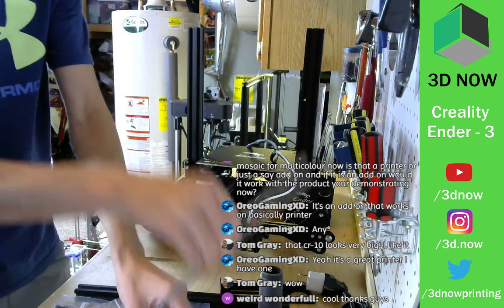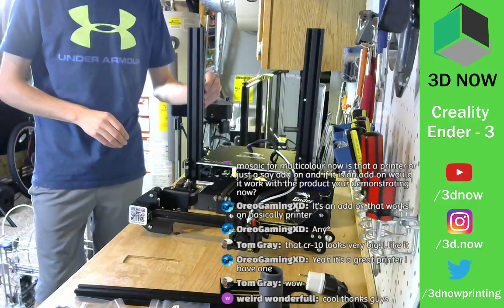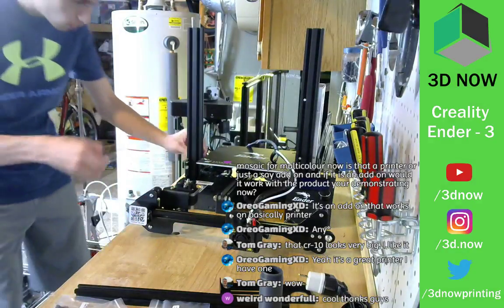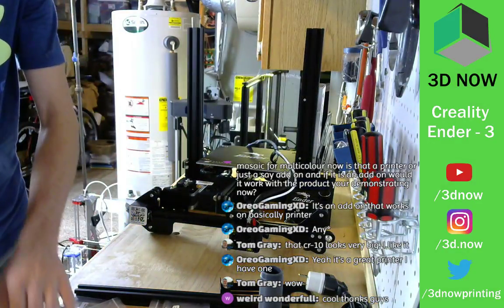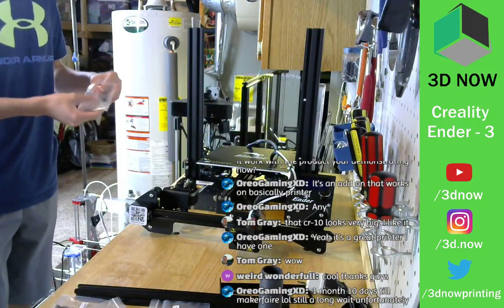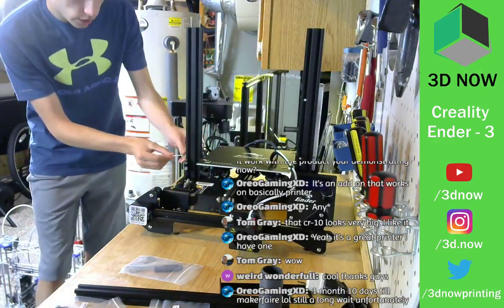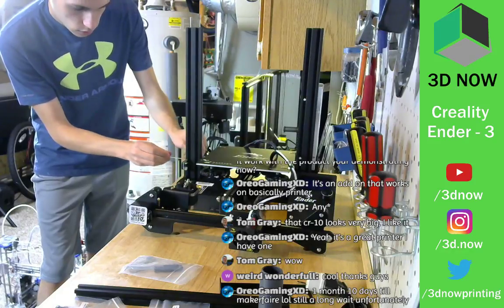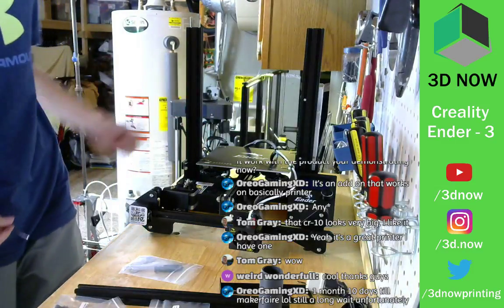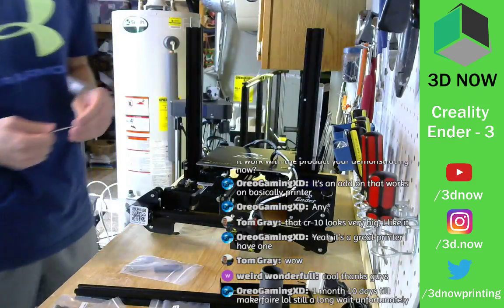So, this is the lead screw. We're going to stick that around back here. Then we have to loosen the set screws over here to put in the lead screw. Give me 1 second. So the lead screw in the back here mates up with the lead nut, which is right here on the X carriage, which allows it to move up and down.